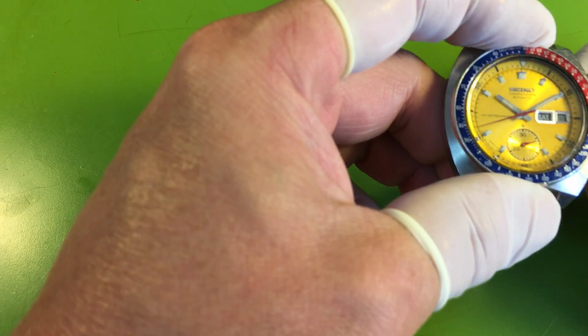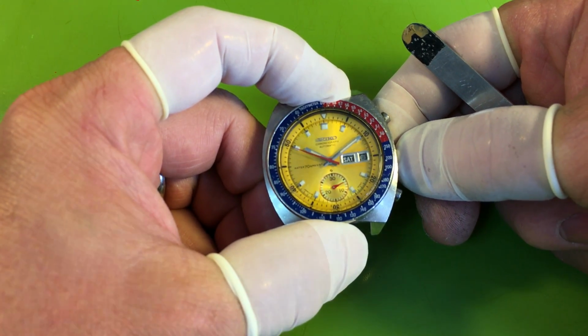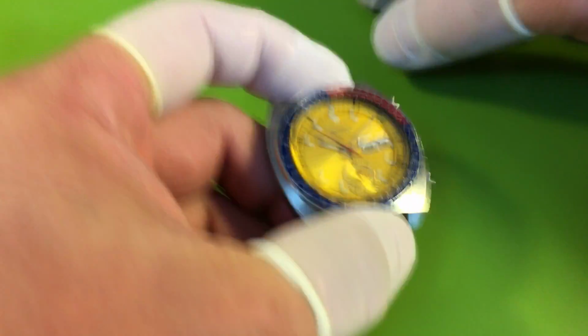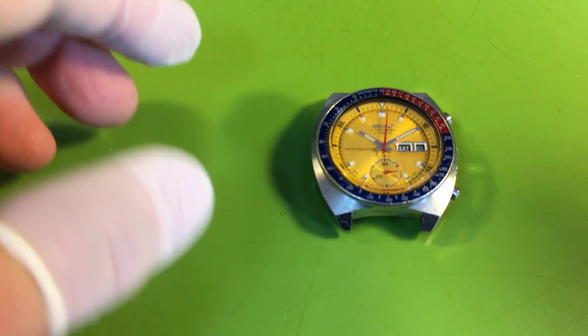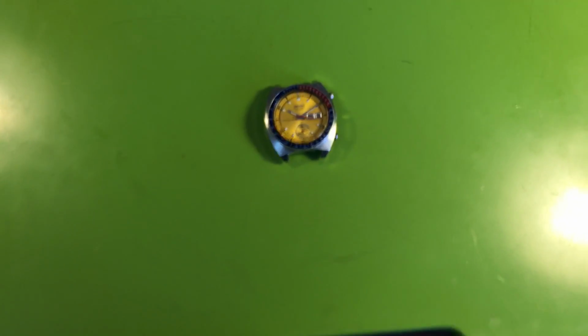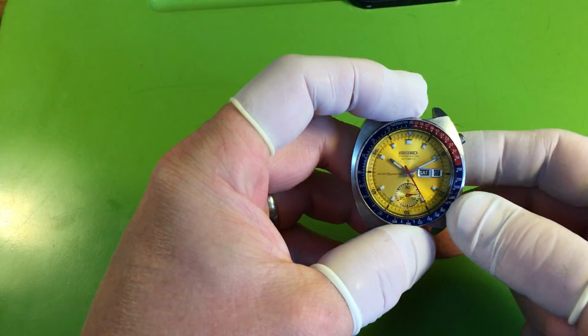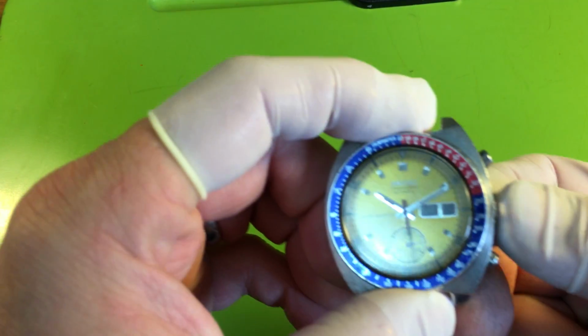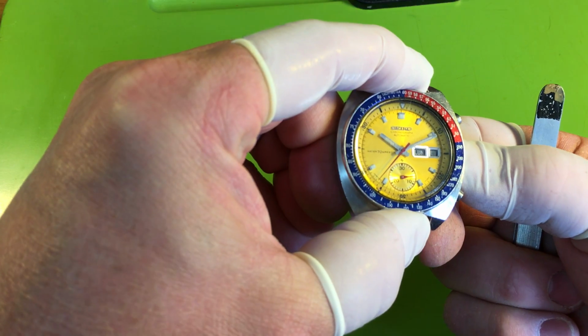One of the things that is interesting is that the watch is a 6001, which I associate with Asia, not home market Japan. So in those cases, what I normally expect is to see a Roman English day wheel. Hang on, this thing is fighting me like crazy. Stop fighting me. That's what I normally expect to see, a Roman English day wheel. This one, however, has French English. There, Lune.